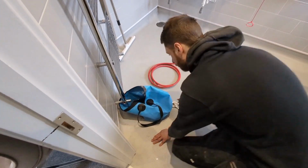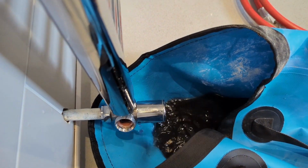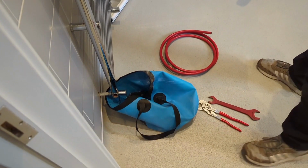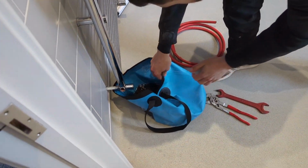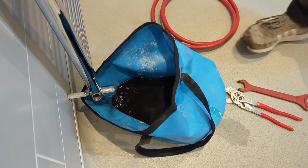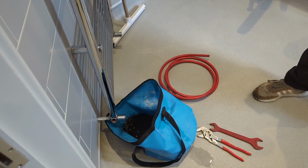So we're just draining out one of the tower rails. System's pretty dirty, to be fair. That's just jet black coming out of there. What do you reckon? Power flush? Power flush, mate. Get them while they're down, mate. Let's see. We'll speak to them about that as well, because yeah, that is bad water quality. Jeez, that's only coming out the tower rail at the moment.